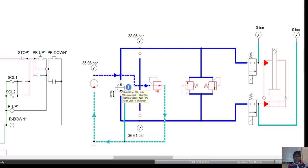When you look at this pump, it is a variable displacement bi-directional pump. The pump is connected to one port of the cylinder and the other flow line is connected to the other port of the cylinder. So how does a closed loop hydraulic system get its own hydraulic supply?